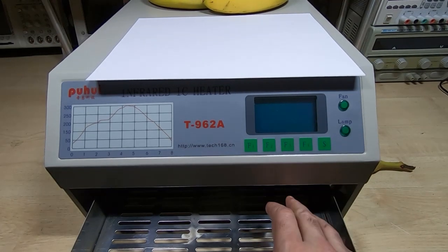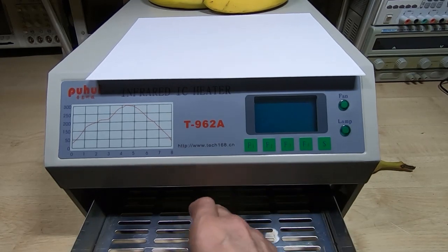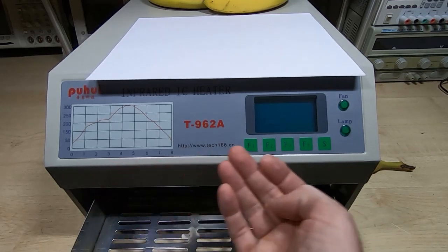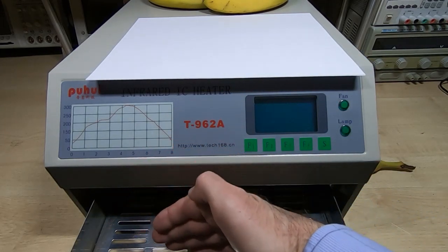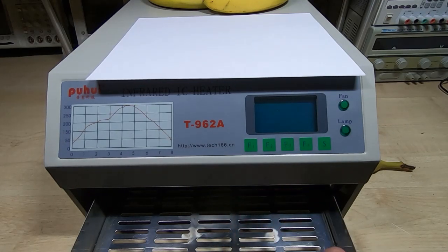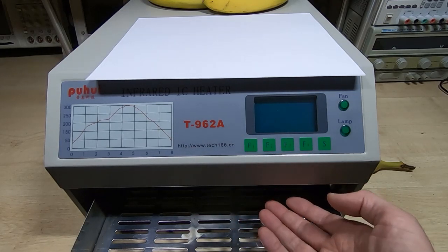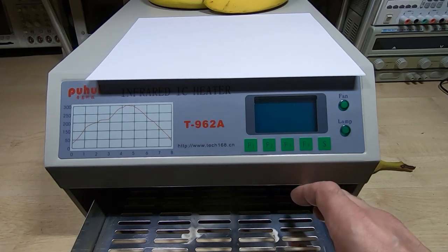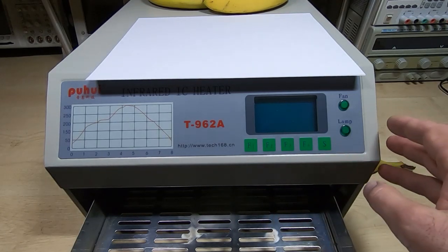It's a real nuisance. On the underside of the heating element, what we're trying to do is avoid the hotspots that are caused by the heaters being in very defined lines. There's 4 heaters and they give heat that is very directional in terms of where the board is closest to it. You're going to get far more heat than where the board is more distant from the heaters. And so what we're trying to do is even out those hot spots, and rather than trying to produce more heat in certain parts of the chamber, it's got plenty of power, it just needs to control it.